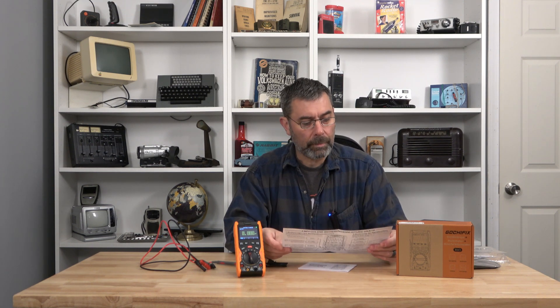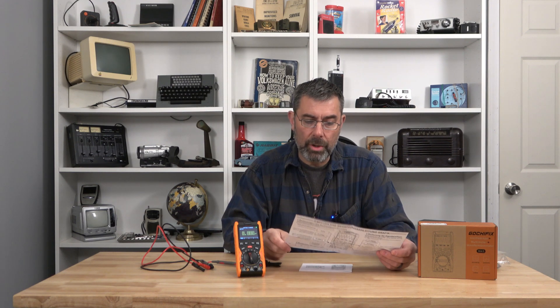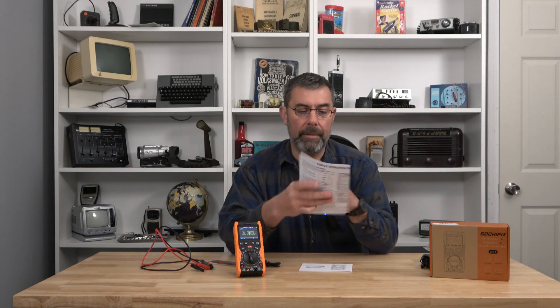It has a simple operation manual and a more complex one. For oscilloscope mode: press Auto for two seconds to enter oscilloscope mode, automatic waveform capture occurs, F2 to adjust the time base, F1 to exit. F2 up and down adjusts the vertical voltage range. There's also trigger select. For the signal source: F1 is wave, F2 is frequency, F3 is duty cycle, F4 is voltage, and auto. There's also a replaceable fuse and a built-in database — you can hit Save to hold current data, then Save again and hold for two seconds to enter the database.